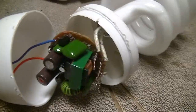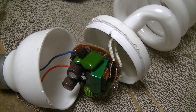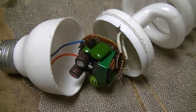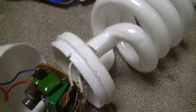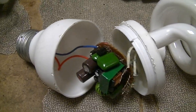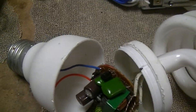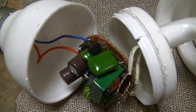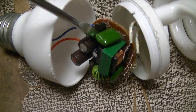This is just a video on the guts of a very crappy, extremely cheap, garbage compact fluorescent lamp — and considering the state of modern fluorescent lamps, that's saying a lot. This is one of these generic crap dollar-store type compact fluorescent lamps, which used to be kind of common, although given the price collapse over the past half decade in compact fluorescent lamps, they've pretty much disappeared from the market. It's a typical, very cheap ring oscillator topology ballast.